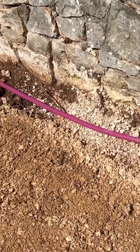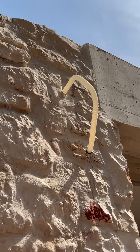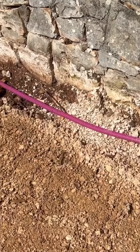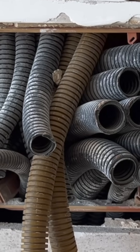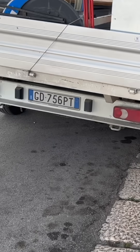We finally learned the colour coding behind the flexible conduits. Black for power, extra low voltage in the white conduits. But what about those other colours? Well, the purple and the green and the brown was the builder helping out. Sometimes electricians can't be on site and you need to ask the builder to do you a favour - and that's what they've done here. They basically put in what they had in the van.